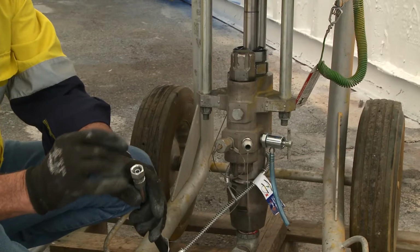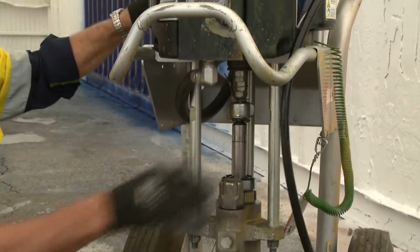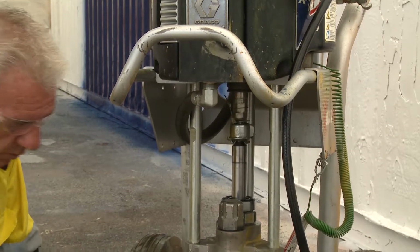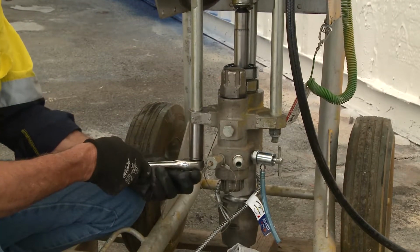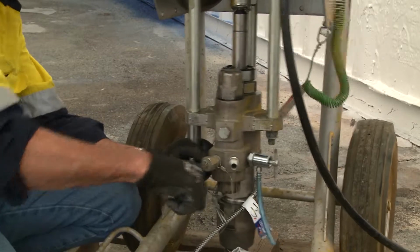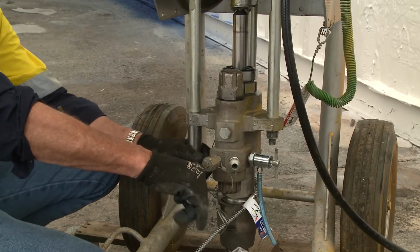Best to put another blank fitting in there or put this up so that it can't be exposed to dirt and contaminants. So with this weeping off beautifully, what we can do is undo these retaining bolts, which are, as I said, nylock nuts. You'll find that because they've been done up for some time, they'll have paint accumulation around the threads. You need to crack them